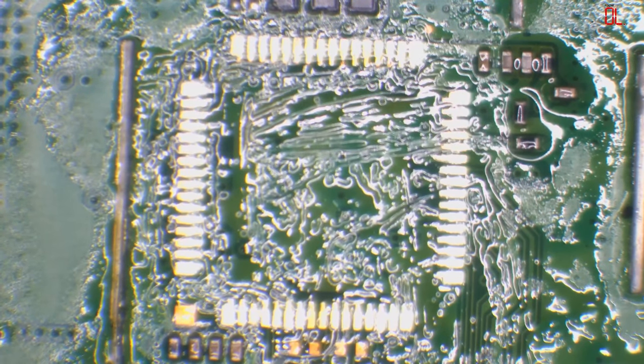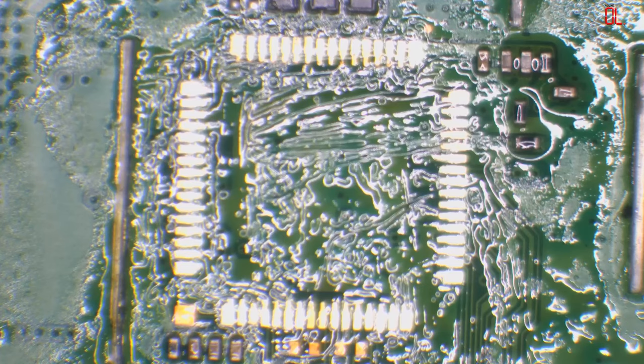And these ones are longways, so I'll go longways. And just basically clear them off. Once I've actually cleaned it off, it doesn't matter which way I go, because I'm not putting any strain on it, but I can go that way just to make sure that it cleans it fully. But while I'm actually wicking away, I don't want to put any excess strain on the pads. It's not absolutely necessary, but it's just risk mitigation more than anything.